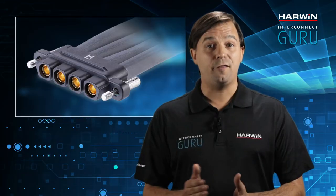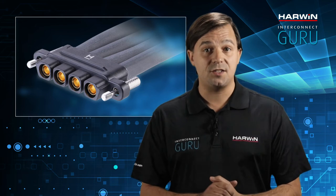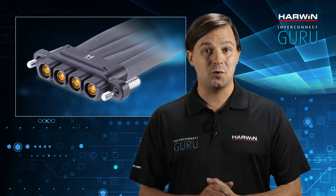When you need added durability and ease of use in the field, screws generally provide a stronger fixing method and are easier to unmate. Larger format connectors can feature thumb screws. These are straightforward and convenient to use as they don't need any special tooling. They are not often seen on more compact connector formats, however, because of the larger size needed for handling.